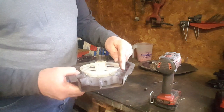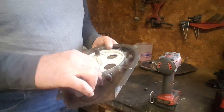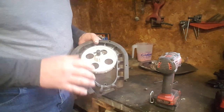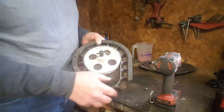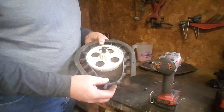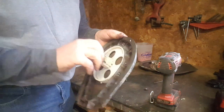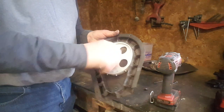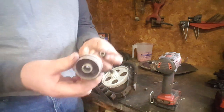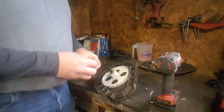We check the belt, make sure none of the lugs are tearing off. Flex it to make sure the body of the belt isn't cracking anywhere, that it's pliable and looks good. For the few dollars each component costs - if in doubt, throw it out. At a hundred dollars an acre of seed and a couple hundred plants to a bushel of corn, it does not take long for it to cost you more to try and be cheap. Then we come to our wheel - all we've got is a bushing and a plastic wheel. Just make sure it fits nice in there, that it's not all slopped out. It's that simple.